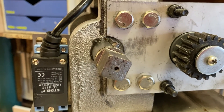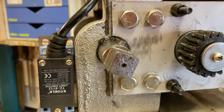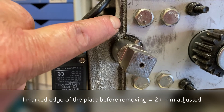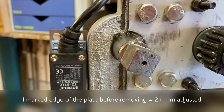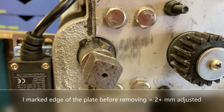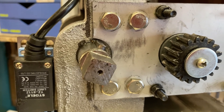Okay, I'm trying to fit it all together. The two gears were so tightly meshed, it just wasn't right. So if you look here, that gap between the black mark and the plate — about two millimeters. I had to undo all the four bolts there, those big silver bolts, and file the holes oval so I could adjust that plate outwards so that the gears didn't mesh too hard.